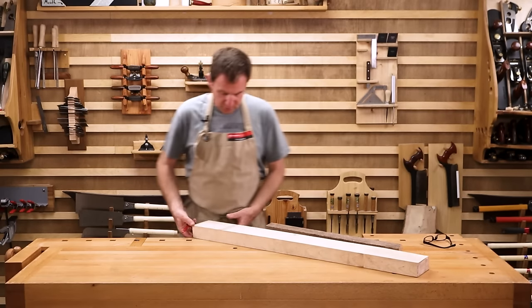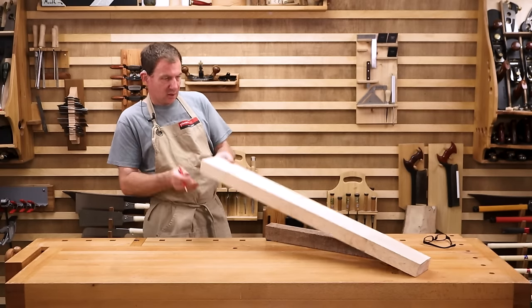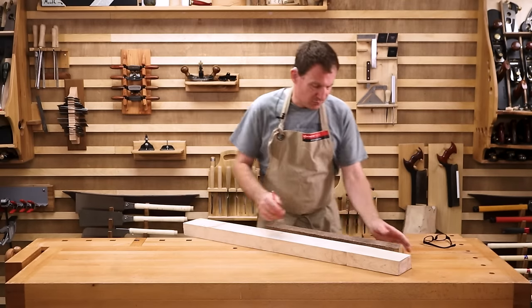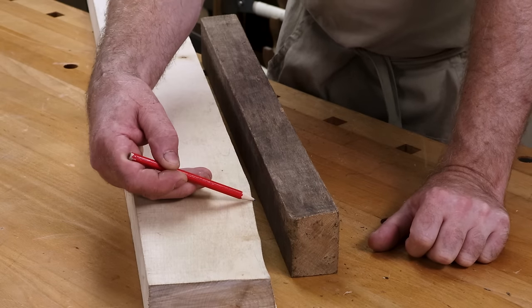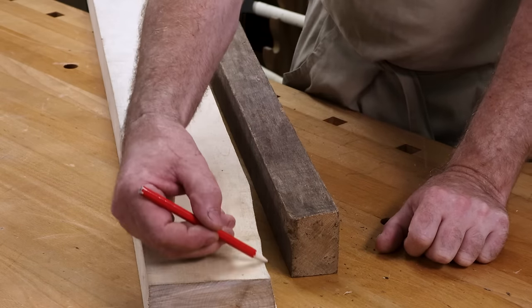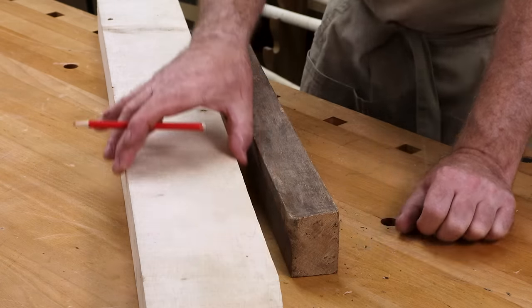The bit of sycamore, just a quick look on the end, is quarter sawn. I've got a centre point, the board here. If we have a quick look on the camera and the close-up, we're missing a little bit here. So there was a heart shake down through here. That's got a crack in it. That's come off. Then the rest of the board is pretty square down through.